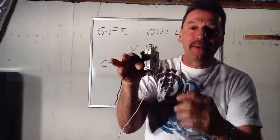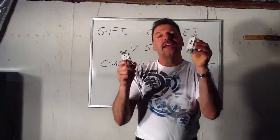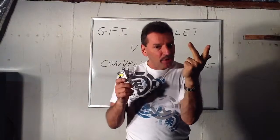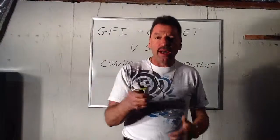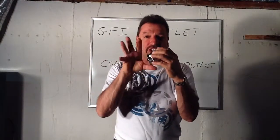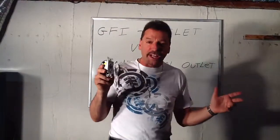That's the difference — this little breaker will pop and save you from getting electrocuted. So what do GFIs do? They save your life. You may see them in the walls all the time in the kitchen, but by law or by code — kitchen, garages, bathrooms — anywhere where you may use an electrical device like a blow dryer or a saw, they want a GFI there for exactly that reason. It senses the electric going and coming, and if it changes because it's not constant, the only reason it's going to change is because the electric is going somewhere else and someone's getting electrocuted.